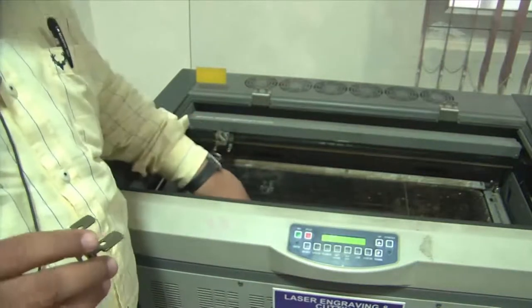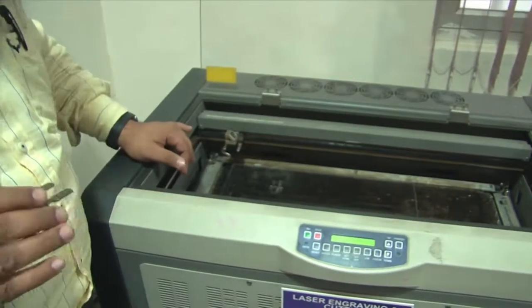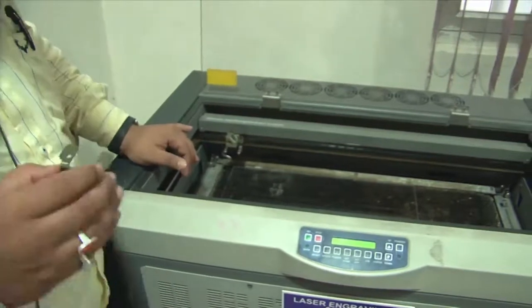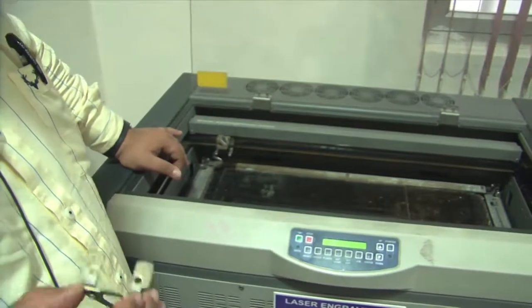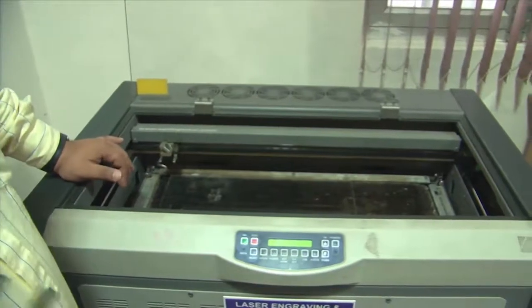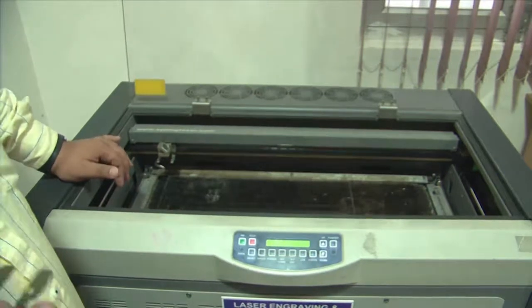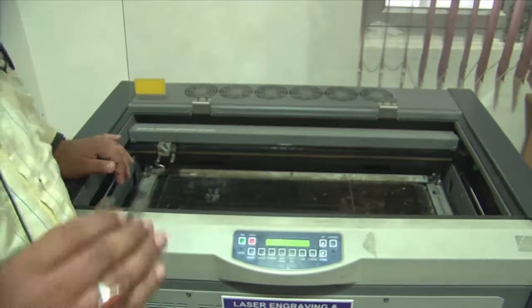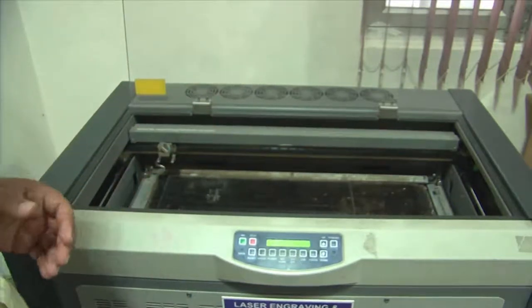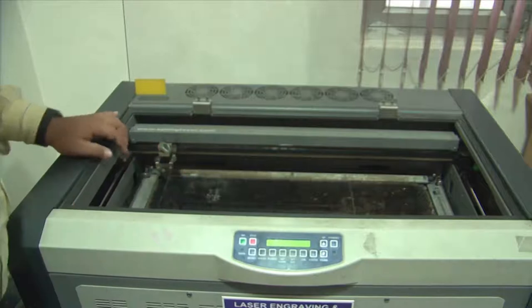One thing you have to remember is that this PMMA surface is highly shiny in nature, which would create a lot of power loss because of reflection. Our group here has formulated a diverse set of strategies where such optimizations can be performed corresponding to the different cutting parameters, so that with minimum usage of power, you would be able to generate a very fine surface. I'm going to detail those optimization experiments in a later presentation module, which would come after this experiment. So I'm going to now put this jig onto the system.